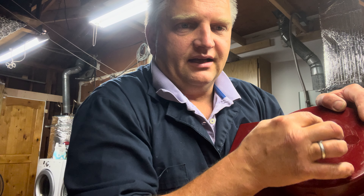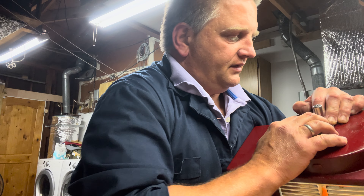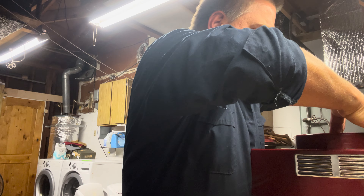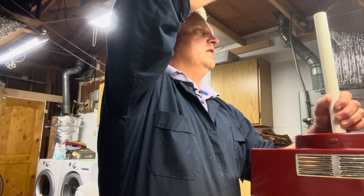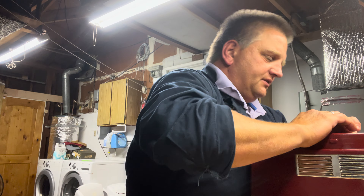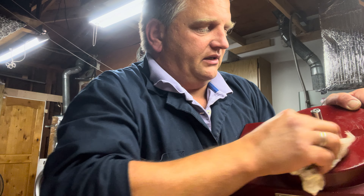Use the whole tube — don't be stingy. You don't have to spread it around perfectly because once the unit starts running, the temperature rises and the centrifugal force of the shaft itself will spread the grease all around. You can see the grease spinning all around as I spin the shaft. Once the grease is applied, pop the seal on top of the shaft, work it slowly with your hands pressing from both sides, then use the three-quarter inch PVC pipe to push the seal all the way down. Wipe the excess grease with a towel.